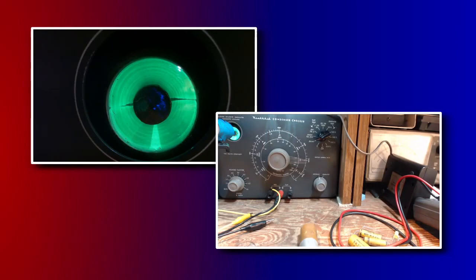little experiment there. I hope you found that interesting. I certainly did. It's taught me a lot about my instruments, taught me a lot about testing capacitors that are in a state not really good enough to be tested, even, except by this leakage test. So I think that's going to become my go-to test for capacitors, is how leaky it is on this checker.